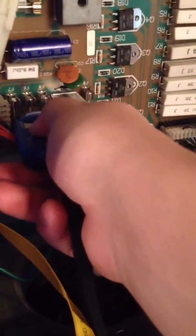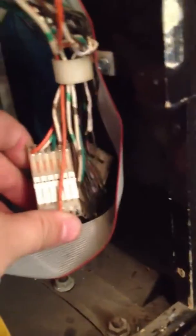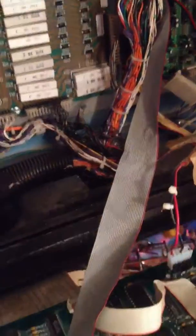That one's at 77, F6 is about 85 — some of that's probably residual heat coming off F7 transferring over. So it's definitely running a lot cooler. I don't know if that's telling me the problem lies within the back box wiring. The plug looks okay just looking at it — I haven't even pulled it apart yet, but I'm gonna do that, check the pins, and see how they are.